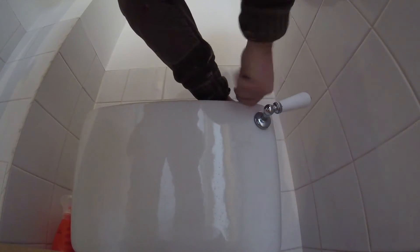Disconnect your toilet from the wall - there should be a couple of screws holding it against the wall, and there might be a bit of silicone there. You just cut that with a Stanley knife if it's siliconed onto the wall. I'll just put a wee cup there to catch any drips for when I disconnect the water pipe. There's a wee weep where the valve is not shutting off completely, so I'm having to re-shut the valve again because it's just slightly letting water through - and that manages to seal up.